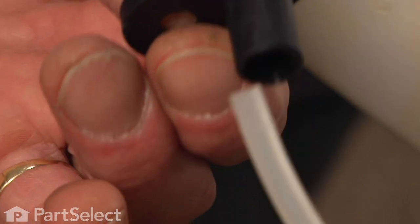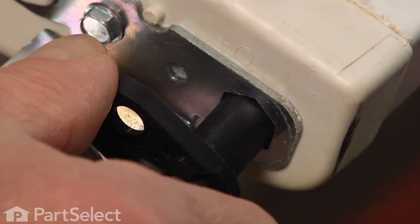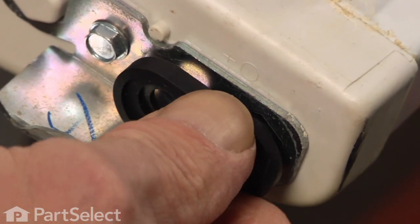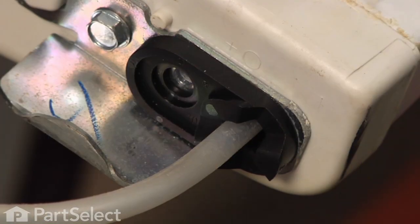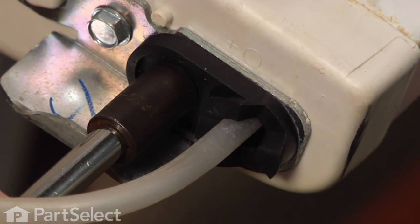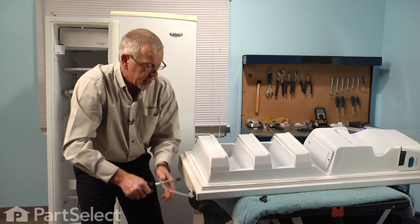Take our new closer, insert the tubing through it, push it into the opening, and rotate it until it's parallel with the door. It has a six-sided base on that closer, so it'll only fit into that bracket one way. Make sure it's seated firmly. We'll reinstall that shoulder screw — just make sure that it lines up properly with the hole in the door closer cam — and snug that up.